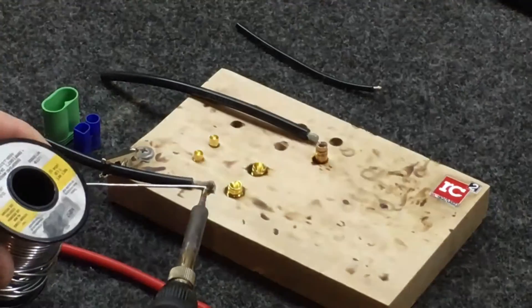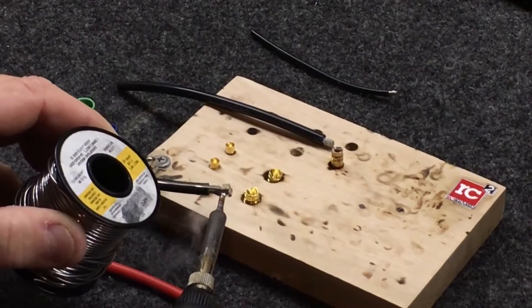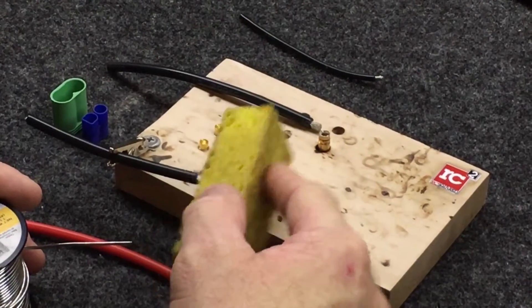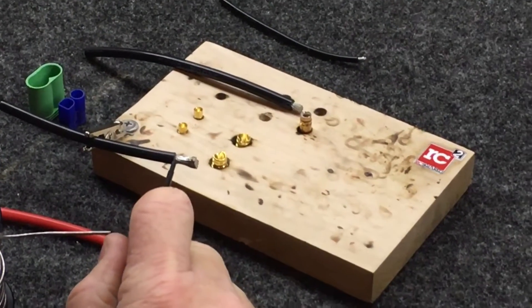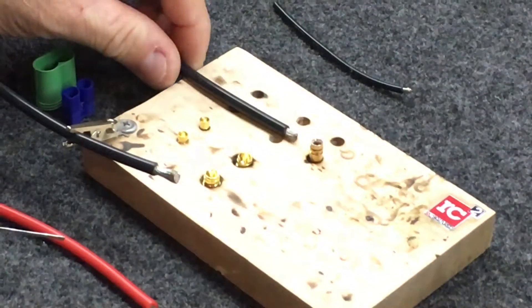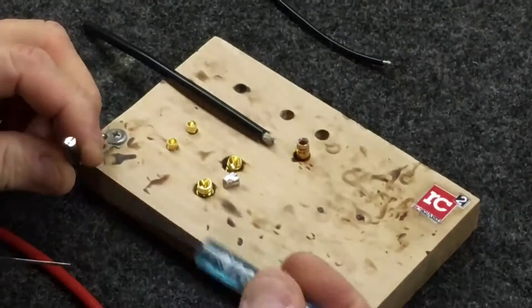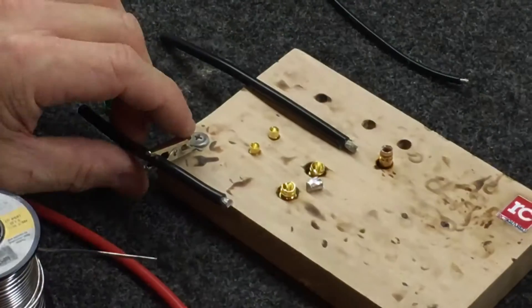If you just paint it on, it's only going to be on the outside of the wire. You want it to draw completely through — you want that solder to coat and penetrate the wire. I'll flip it 360 and check the other side; once you start applying solder all the way around, it'll draw in. I'll cool it off with a lightly damp sponge. When we check the cup, we realize a good half of this wire would still be out of it — this is how short it should be to fit in the cup perfectly. Using side cutters, we cut it, and if you look inside you can see that wire is soldered completely through.